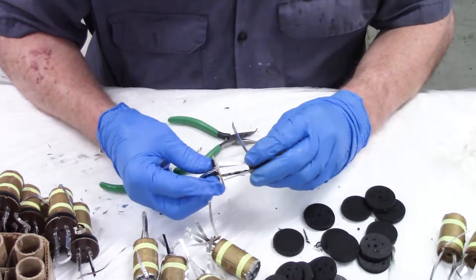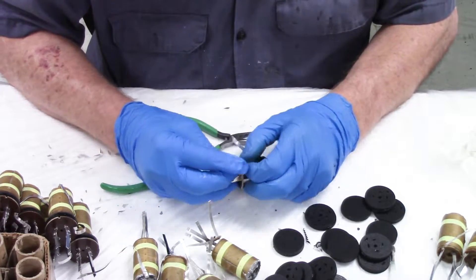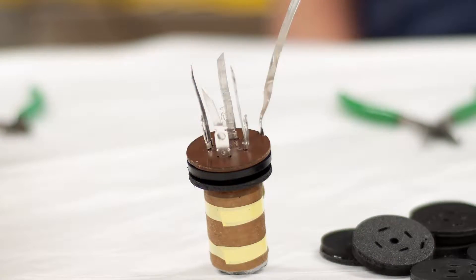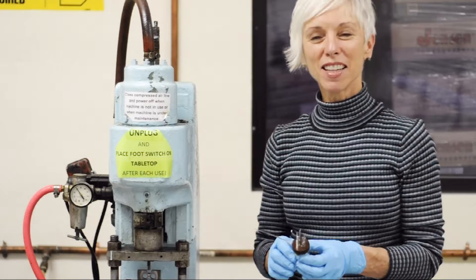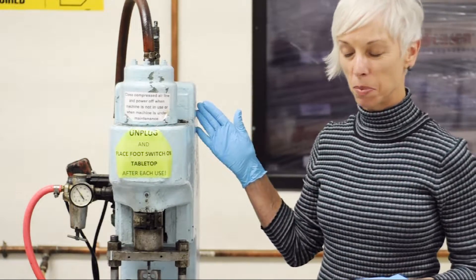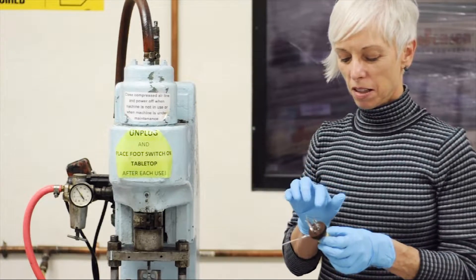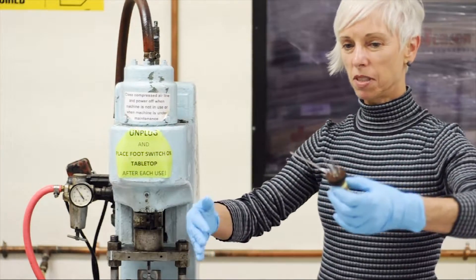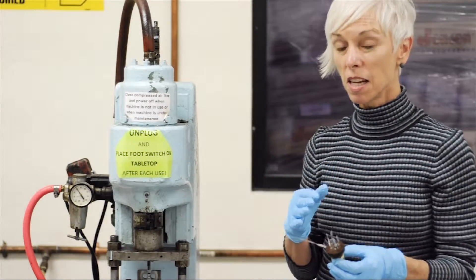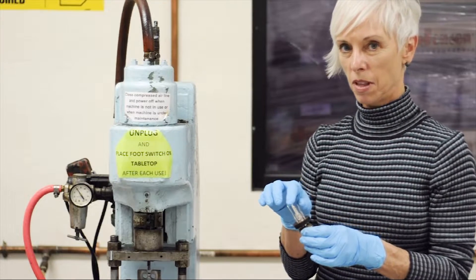The cap holds the different solder lugs, and the surface of the cap is clearly stamped with the section markings: square, moon, triangle, and blank. Now that the capacitors have their cap and gasket assembly in place, it's time to come to the crimper. This machine actually does two things at once — it crimps the little arms of the solder lugs tightly around the anode tabs, and at the same time cuts off the excess anode tab that is unneeded.